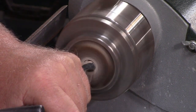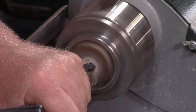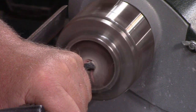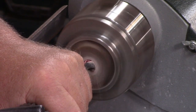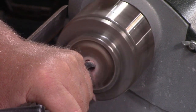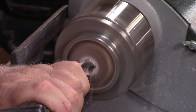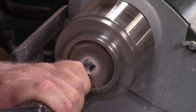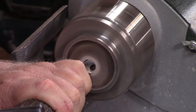Once I've drilled the first half-inch hole, I'll swap to the three-quarter. What I'm doing in this procedure is fitting a ring core — a comfort core with a flat top — which is a stainless steel from Turner's Warehouse. We're essentially gluing that ring core into the block, so we drill it out to remove material using a couple different sizes. Then we'll use the boring head to precisely get our size down.